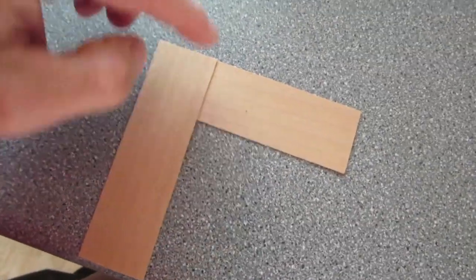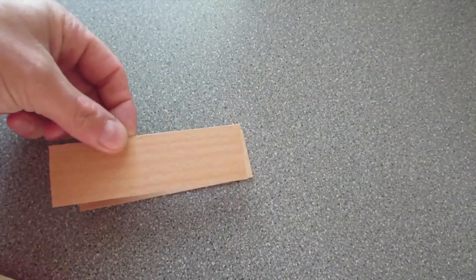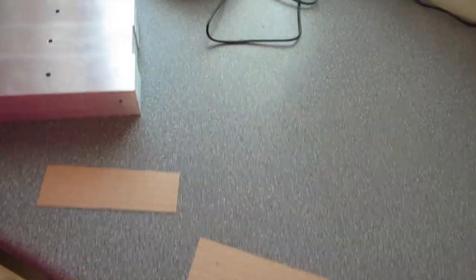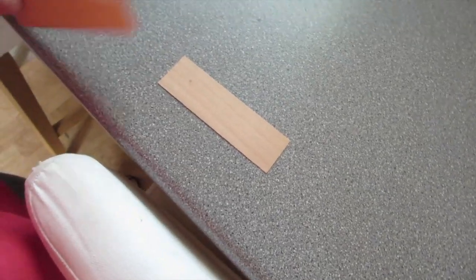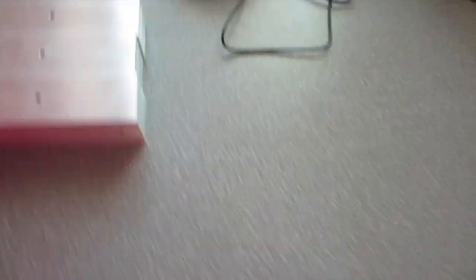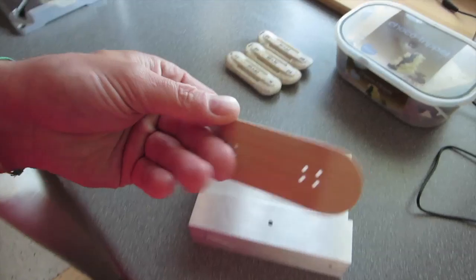So it's going to fill the whole deck but the grains go that way. And then you put another piece — if you're going to do five plies, another piece, and then the top piece. If you're going to do four plies, I suggest — and I might be wrong, but this is how I've done it, and this is how this deck is made — that the bottom and top have the grain running one way, and the two middle plies run the other way. It's really, really strong and it works well. It's completely up to you, but that's my approach.